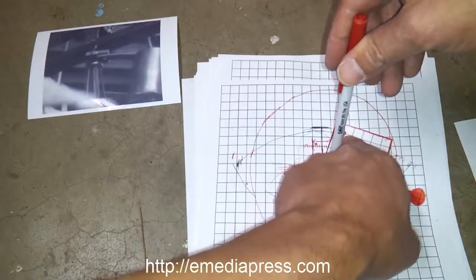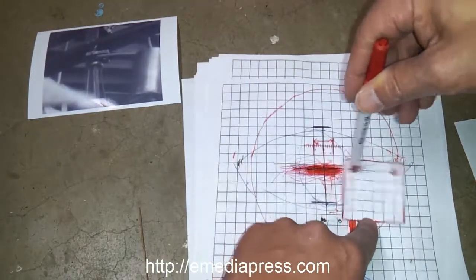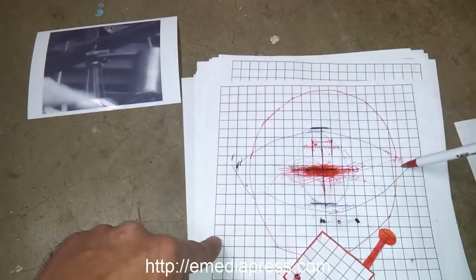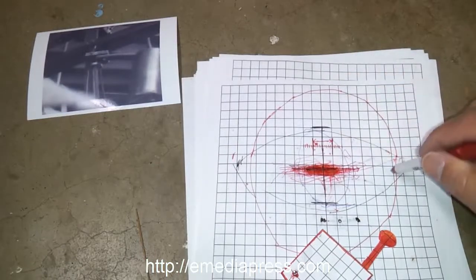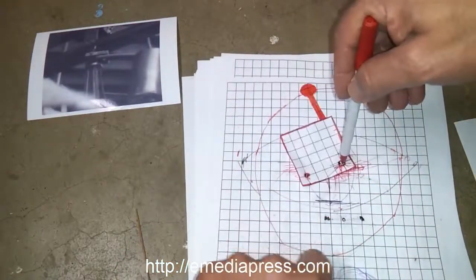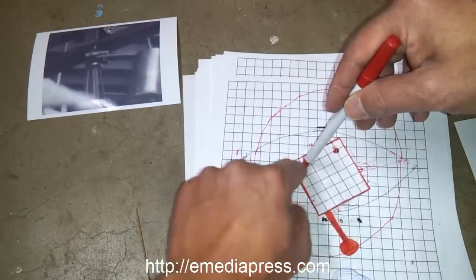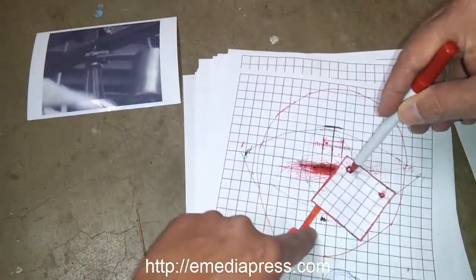Now that's just the upper weight, but if you follow the path that this shaft is doing, which is connected to the lower weight, it's doing the same thing, because when you come down this way, look where that's tracing, right? And then when you whip it that way, it's going to force it out there. So basically it's kind of following this oval here, right? That's what the lower weight shaft is doing when the angle is changing to cause the lower weight to fall to the incline. So it's not going in a circle, it is going in an ellipse. Follows around. See, you can go like that, flicks it around. See, back and forth motion causing that to go around, but it's an elliptical orbit. So again, the center around which this is rotating is constantly moving like this, okay, like that.